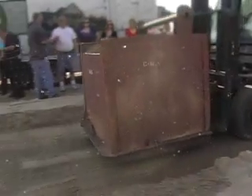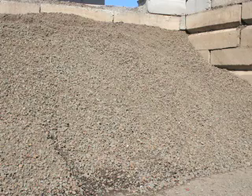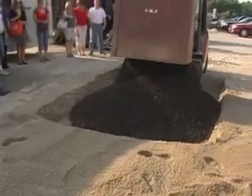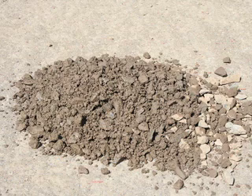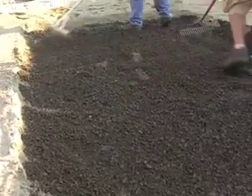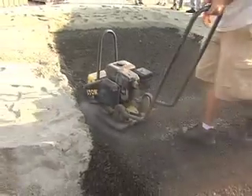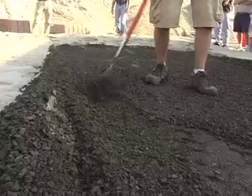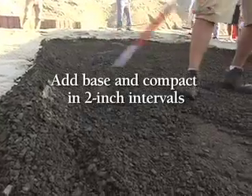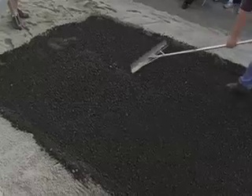We're really close to starting to lay those pavers, but before we start, we need a good solid base. A good base material is important because it will help prevent frost heaves and plants growing into your patio. The pros at Chicopee Mason Supplies can advise you on the right base material and supply it directly to your work site. We like a coarse gravel because it will drain properly. Begin placing gravel and compact it with a gas-powered plate compactor — you can also use a hand tamper. Grade the base as closely as possible to the contour of your finished patio, and keep compacting and adding base material in 2-inch intervals until you are 3 inches below your desired finished height. Don't forget to slope the base away from the house — even a slight slope will help keep water away.